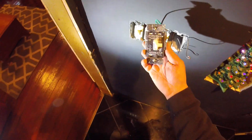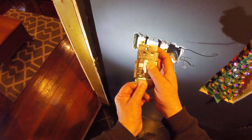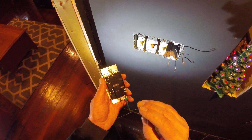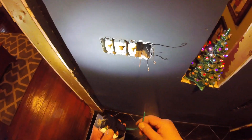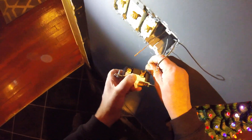This particular dimmer is the Ariadne, made by Lutron. It functions as a regular toggle on/off. For single pole operation, they want you to use the bottom two screws — it does not matter which of those two screws the wires go on. Typically your hot would go to the oddly colored screw.